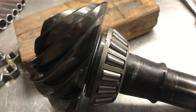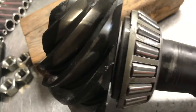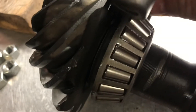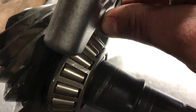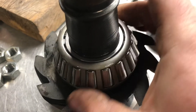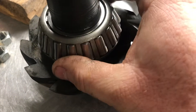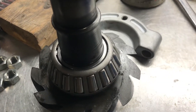I did it - it may not be easy to tell in the video, but there is more space there now. I'm hoping that this puller now has enough space to get in behind the bearing and put all the pressure on the inner race of the bearing, which is right there. If you put any pressure on the outer race it's going to bend this cage and it'll be ruined. I'll get it all set up and show you what it looks like.